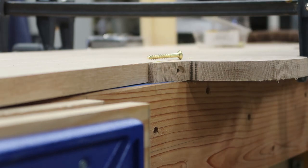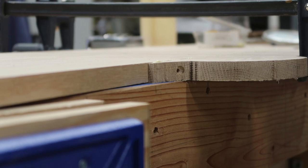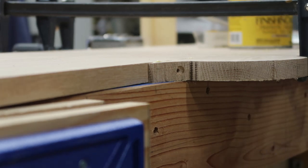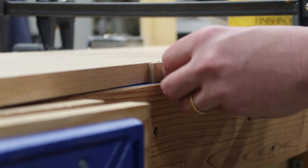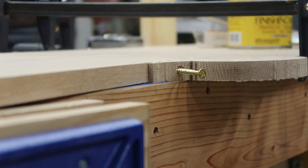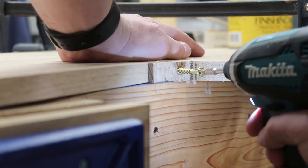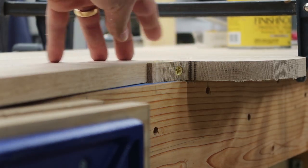I'm finishing the pilot holes for the brass screws because they will break if you don't. I like to put a little wax on them — just a little dab — because I don't want it to get on any of the wood since it hasn't been finished yet. Then I'll drive it into the hole and hope it doesn't split. Got some squeeze-out, then one more screw on the other side, and I'm done for the night.